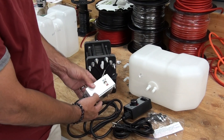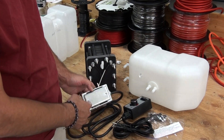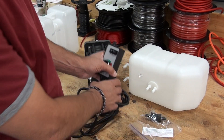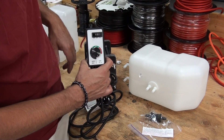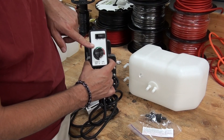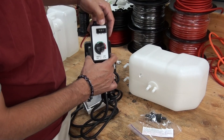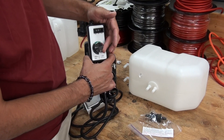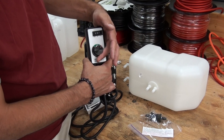There's an on-off switch on the converter — to turn it on, flip that to the on position. On your controller you can either use the full position, which bypasses the controller and puts straight power to the generator, or you can put it on variable where you'll use the dial to control the output of the generator.